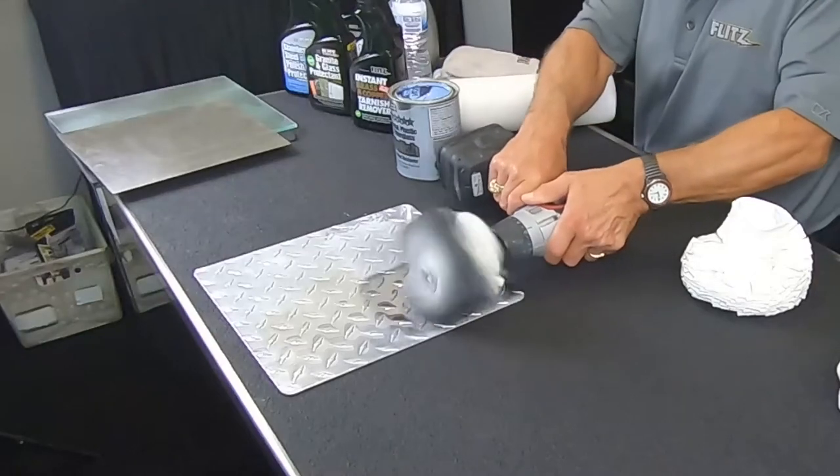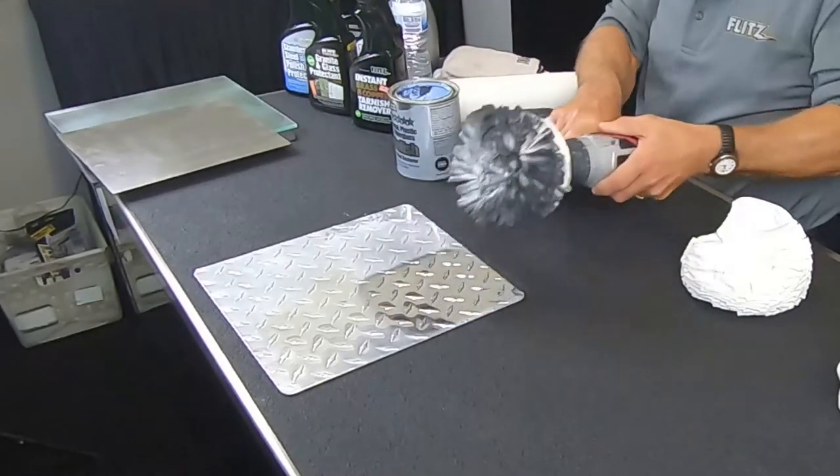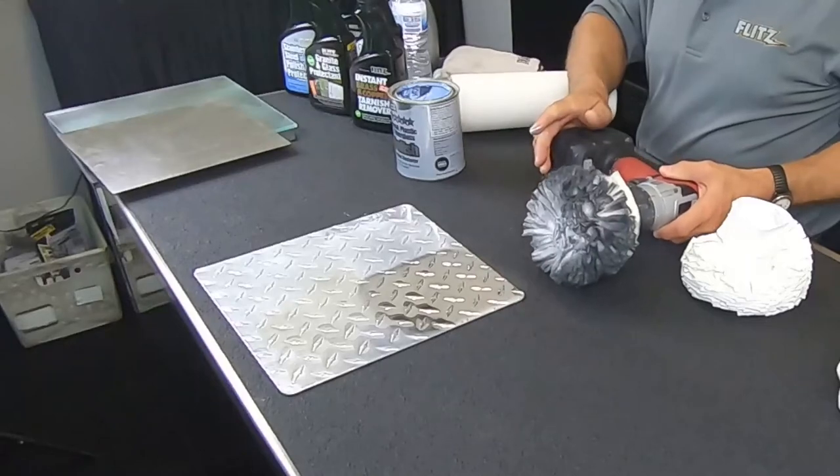The object is, if you can use the drill up to 2,500 to 3,000 RPM, it gives you the best performance. You can see in seconds how it brings the aluminum out to a mirror finish — so much easier than by hand. The before and after is unbelievable.